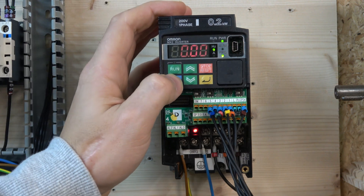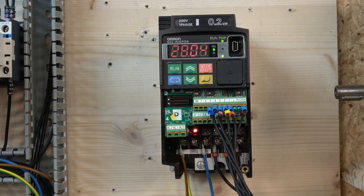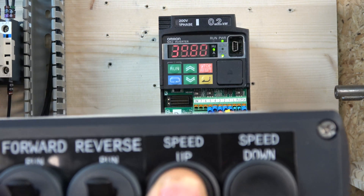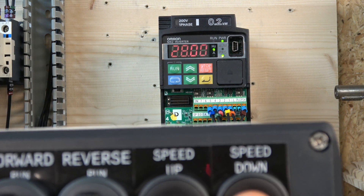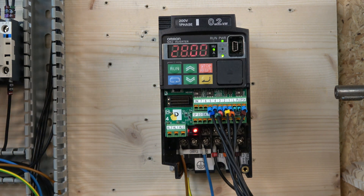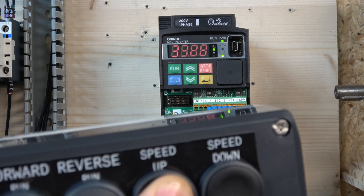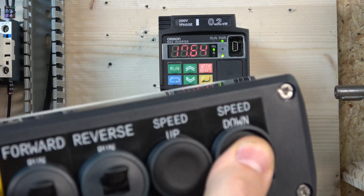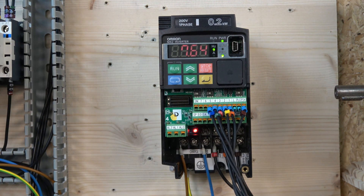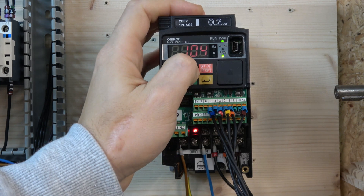If you want to know what speed it is, you can go and check that in F001 — in F001 you can actually see what speed is going to be, and you can adjust it to whatever you want before you start. You can't see that in B001 monitoring, but you can see it in F001. When it comes to the up and down speeds, my sensitivity is really high — you barely touch the button and it changes rapidly. That's very much dependent on your acceleration, which we can change in F02. Let's change that to 10.